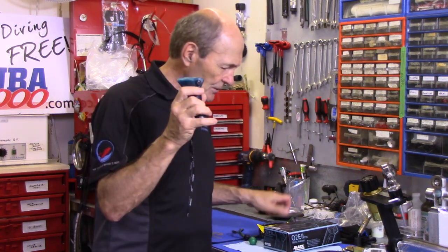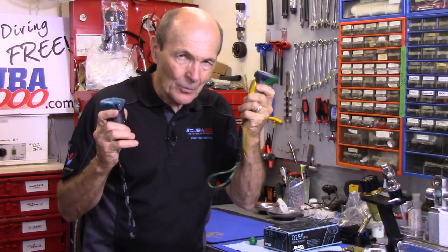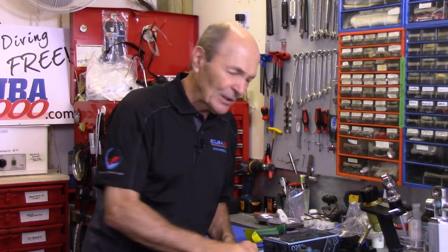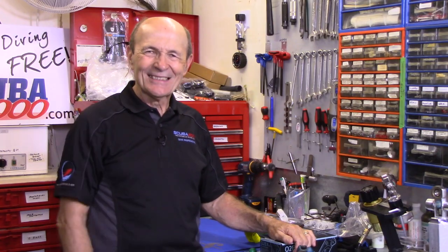If you don't analyze a lot of gas, that sensor can last several years before needing replacement. Replacement is easy — four screws, new sensor, new battery, put it back together and you're good to go. One of these should last for years — we've used ours in the store for five to seven years and it still works really well. If you're big into nitrox and want your own analyzer, I'd probably recommend one of these two. Between them, the handiest is the Analox. There aren't that many options on the market — only about half a dozen. That's enough for today on analyzers. Talk to you real soon — Alec Pierce, Alec Pierce Scuba Tech Tips.